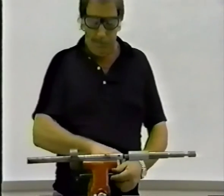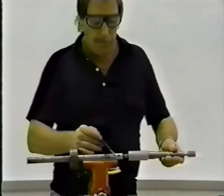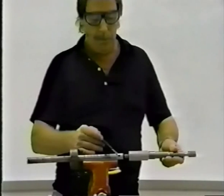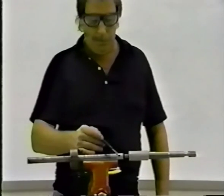Here is the indicator pin. This indicator pin provides indication of how far the undercut blades are extended from the tool shaft. When the indicator pin is at the end of its travel toward the drive end, the blades are fully retracted.